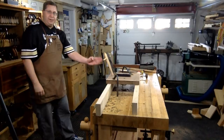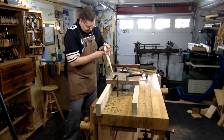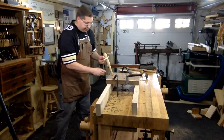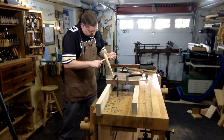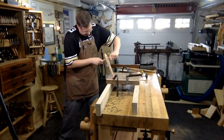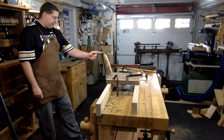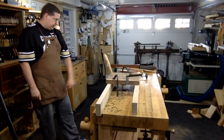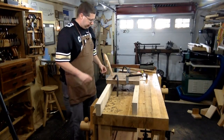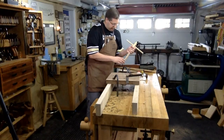22 degrees. Now, as I come and stare down my sight line, look at that little brass tip. I'm leaning a little bit to the left. So I've got the angle right, but the 90 degrees is off now. So now I need to lean a little bit onto this side of the hole to straighten it out. And now as I look at the brass bit and my center line, it all lines up. I suppose I could put the square in, but yeah, we're good. Have I said how much I like the little brass inlay at the top? Have I overstated that yet?